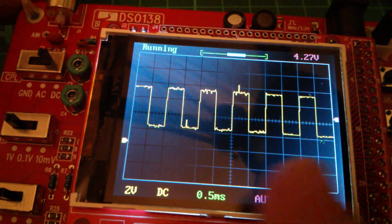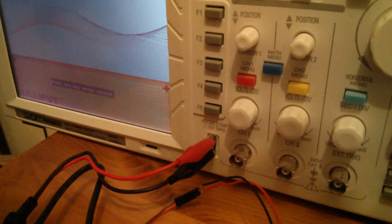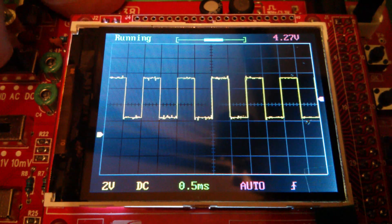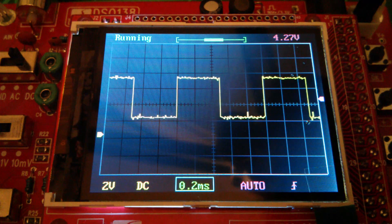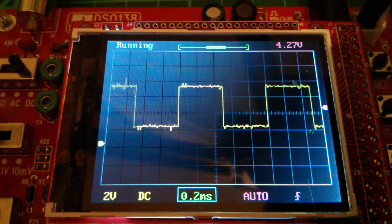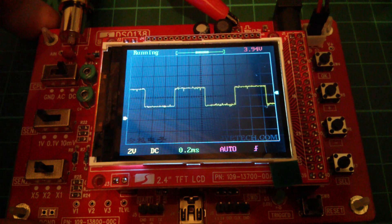Here's another square wave — nice and accurate time base, but I suppose it would be because it's locked to the crystal on the microcontroller. I've also turned off the overhead lighting because it was reflecting a bit. This is the 1 kHz 5 volt square wave coming off my reference oscilloscope, so that should be completely noise free — and as you can see it's not. It's just full of noise, so it's definitely the DSO-138 that's creating this noise. I understand from some comments that there may be a new, less noisy version of the main board.